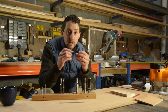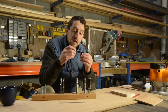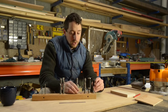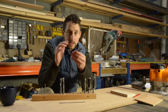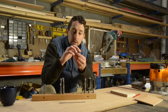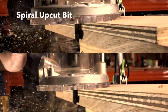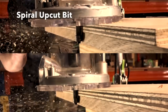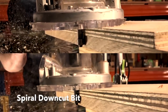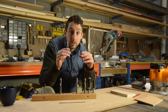There's no real reason for chips to go out the top with a straight bit except for general pressure and buildup, so if you're doing really deep cuts into timber and you've managed to plunge down, you can accumulate chips in there really easily. With spiral bits, they have a direction like a drill bit — the chips move up the shank and come out the top. A spiral down cut bit cuts directionally in the opposite direction: it pushes the chips downwards, which can have a benefit for some applications, but it's not going to be for plunging.